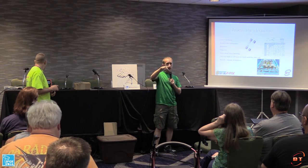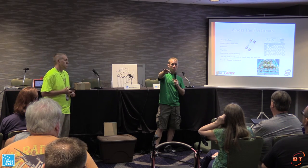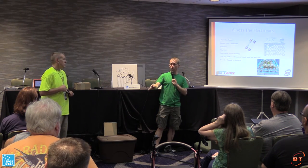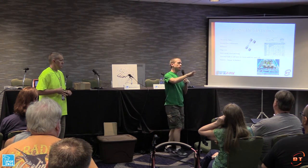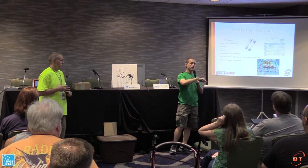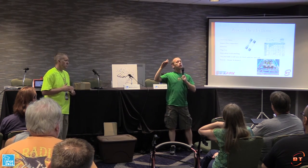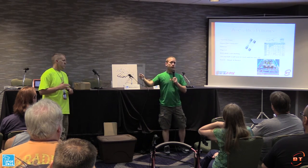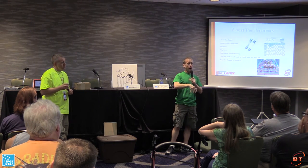And I know Rotten Dog, if you go out onto the show floor, there is a full display of Rotten Dog boards on Arcade Shop's table, and they look wonderful. My personal fear with those, because I've kind of been here with some boards on the arcade side, is if that vendor goes away, support for that board will go away. If that board is available and you get it, make sure you get schematics and any information that you can get on that board, so that a year, 2 years, 5 years down the road, if that vendor has gone away, you've at least got some basis to maybe repair what you've got.